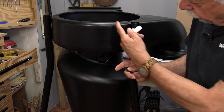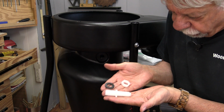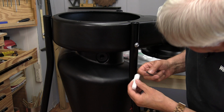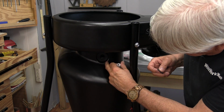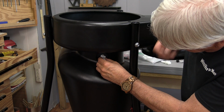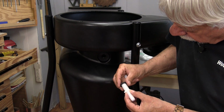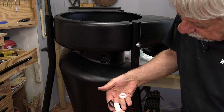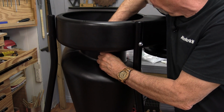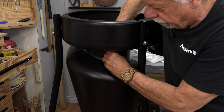Now the other thing that you need to do before you put the impeller on is, in the bag you will find two fittings like this. And I had a little bit of difficulty trying to find this, but here is where one of them goes. The other one will go in the barrel underneath. You'll have a washer, so you put it through the wall, put the washer on the outside, and then you'll have a nut to tighten it down with. So just slide it through, put the washer on the back, and then tighten it up.